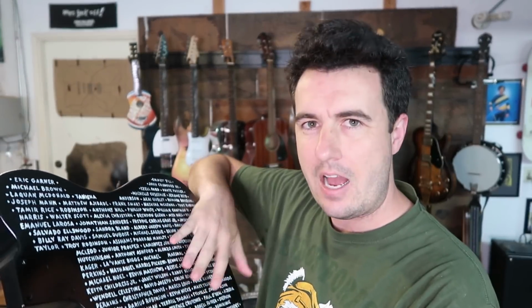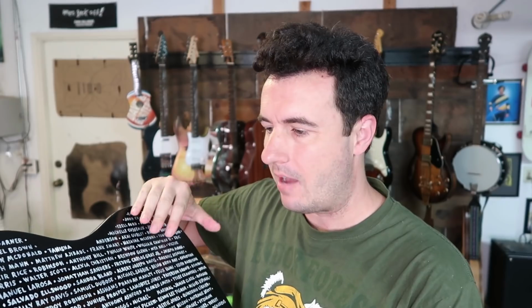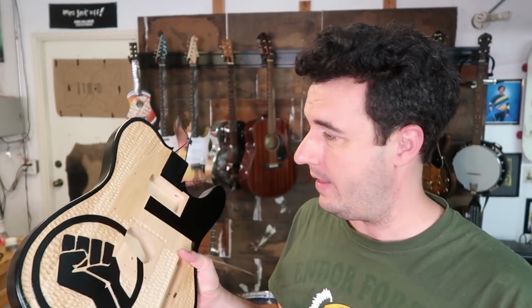Hey, it's a couple days later, and this is ready for a level sanding, which means I sand it down, kind of knock some of the high spots off of it, and then I can coat it with more lacquer and really get a nice smooth shiny finish to the entire guitar. I'm not gonna have time to do that this week. That's gonna have to be in the next video.